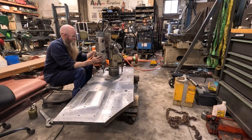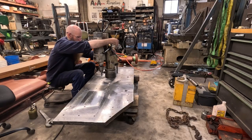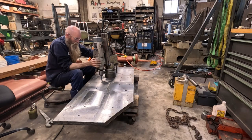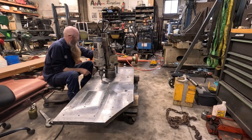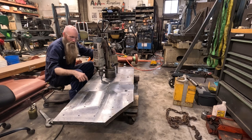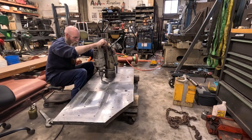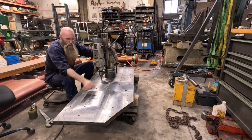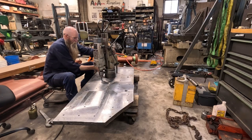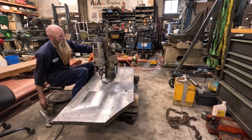It may not be all together awful that I'm doing this with my old tap. Some of these holes, the first few especially, I wasn't hitting my alignment dead on. The reason was that I had indexed off the top and end of the plate, but in order to reach all four of these middle ones I couldn't set the plate up to reach the end. So I got back on my pattern by just popping into one of their holes. I've got a little bit of misalignment in some of these bores.